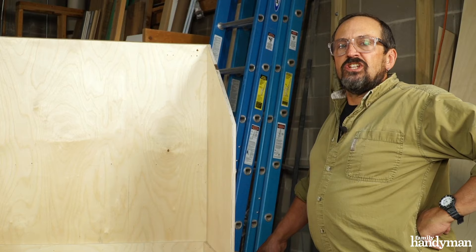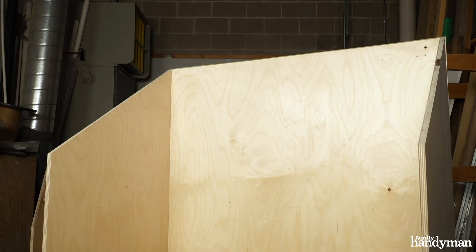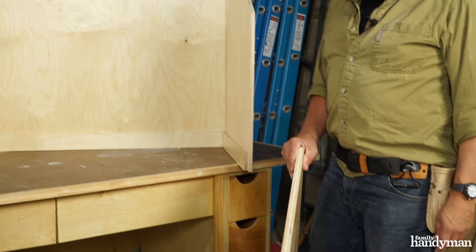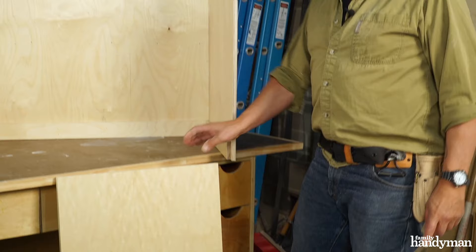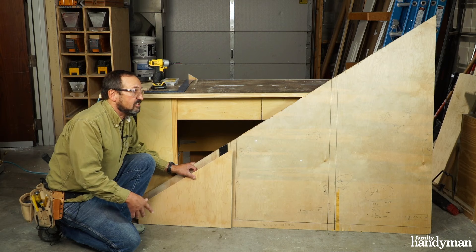I finished a cut list for my plywood to build my drawer boxes. I decided to use half-inch Baltic birch for the sides and the backs because it holds screws well, finishes really well, and once it's sanded out it has a nice appearance for the open edges. For the bases and the shelves I'm using three-quarter veneer ply that came pre-finished. Before I cut my parts out of the half-inch ply, I pre-finished that with water-based poly as well.